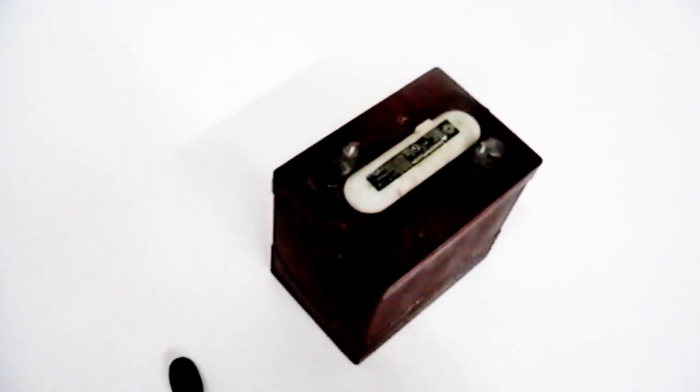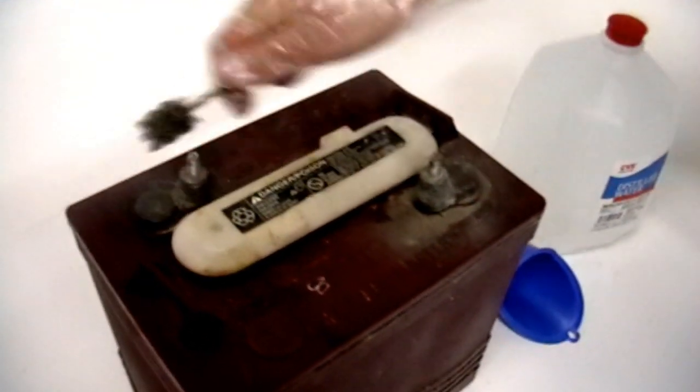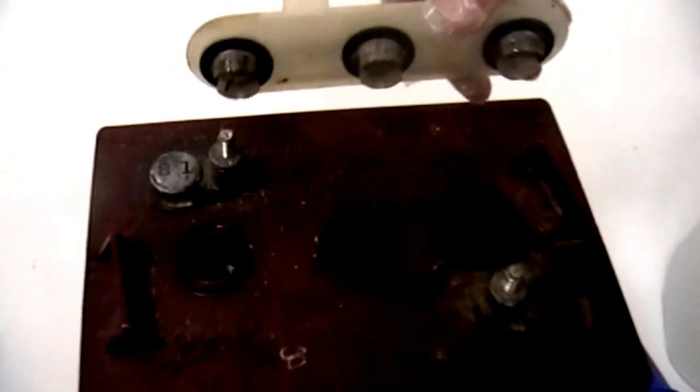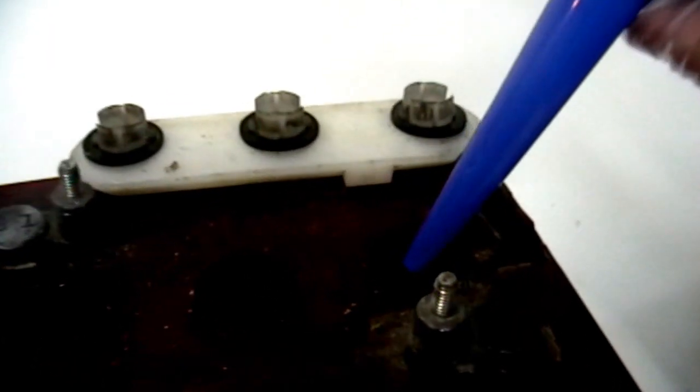A physical inspection is really important as it can save you from future battery trouble. Replace cracked or broken batteries, and clean or replace rusted or broken connections. On flooded or wet batteries, check the water levels. The water level should be high enough to just cover the plates. If water is needed, only use distilled water and do not over-water, as it can spill and the electrolyte is very corrosive.